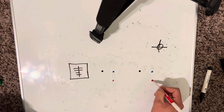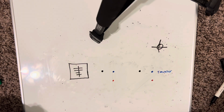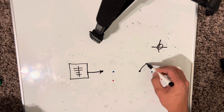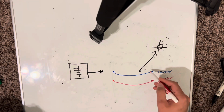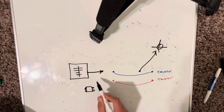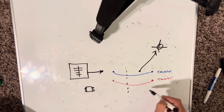I keep mixing up the black and the blue, but anyways: the black is the common, the blue is a traveler, and the red is the other traveler. Power from the panel connects to the common right there — one side power, one side switch leg — and then your one traveler wire here and your other traveler wire here. These screws represent the switch, and a three-way switch looks like this with four screws, representing the common and the two traveler screws. This represents two separate switches.